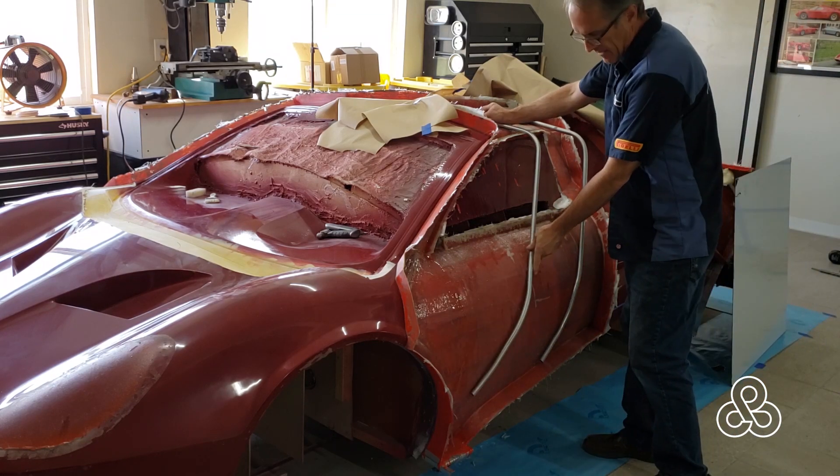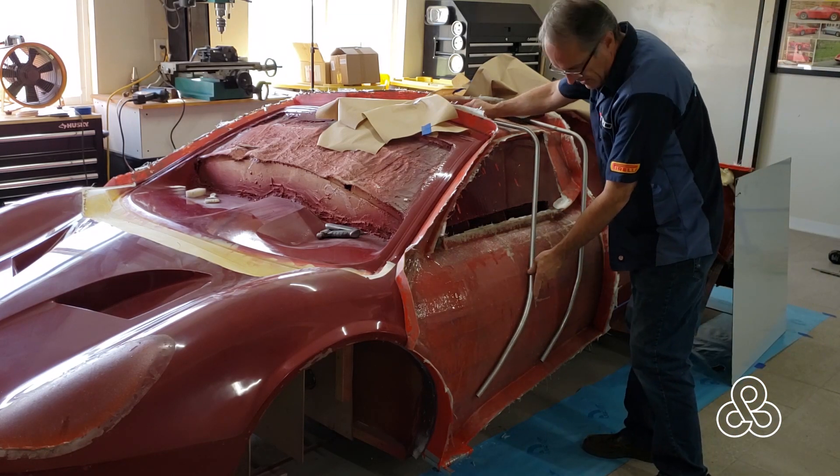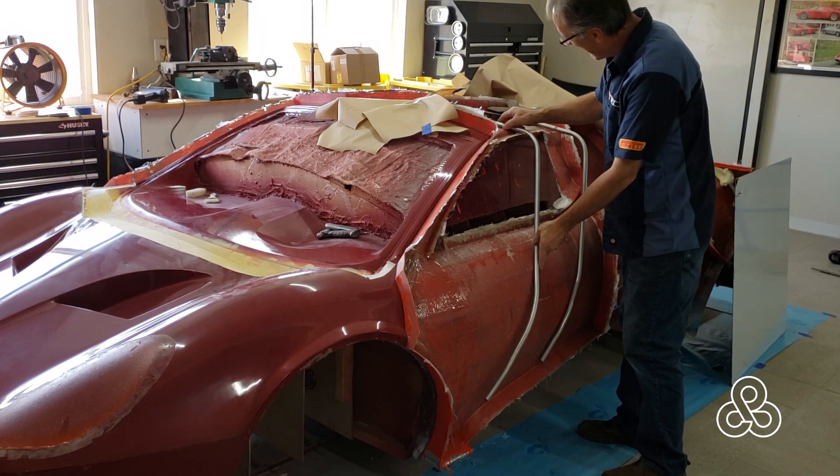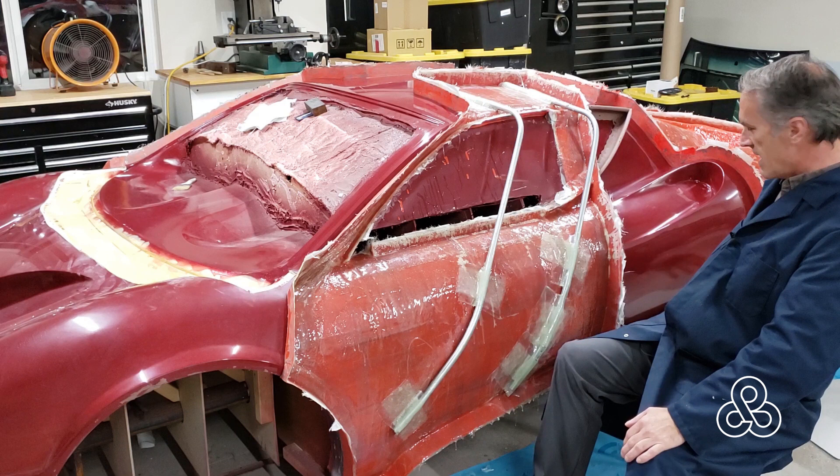It's just a matter of bending these pipes until they fit the contours of the mold. Once we've got those ready to go, hold them in place and attach them to the mold with what I call the band-aid method — a couple of scrap patches of cloth and mat with a little epoxy resin to bond those pipes in place, and they will be there forever.